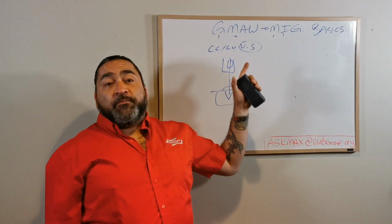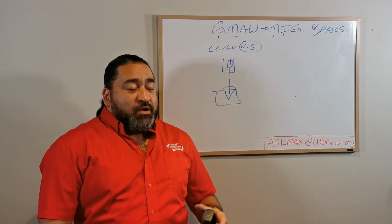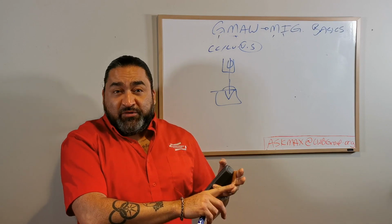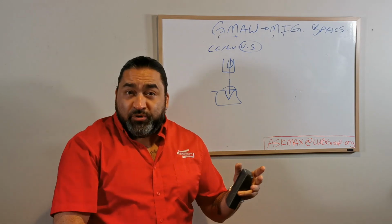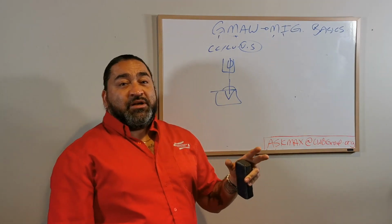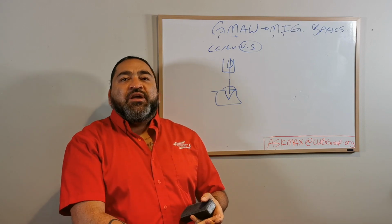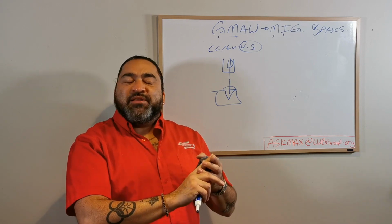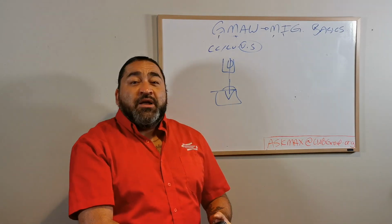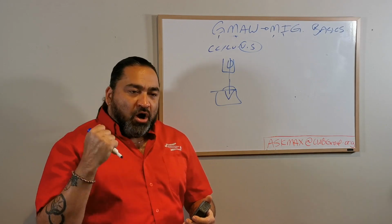This is the future, especially for pipe and pressure welding. Now, if you've been anywhere, the Lincoln College down in Cleveland, the Miller College, or Fronius, if they'll come to you, which I've been to all three of these, you will learn that this is where everything is going because I can now do my root, fill, and cap with one machine. And MIG was never good, or GMAW was never good at the root weld because it's a CV process. All right? But with this new mix process, now my roots are bang in there.